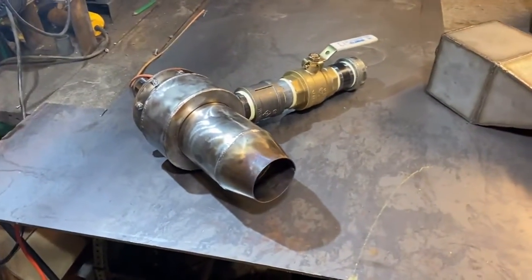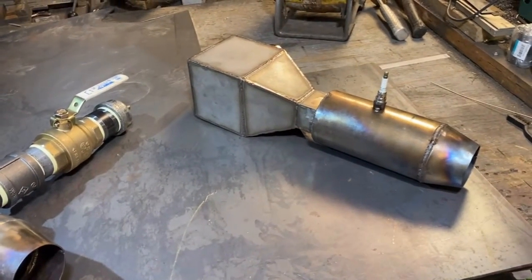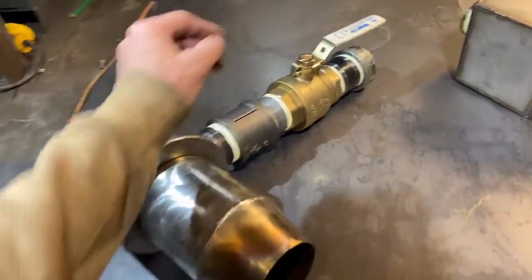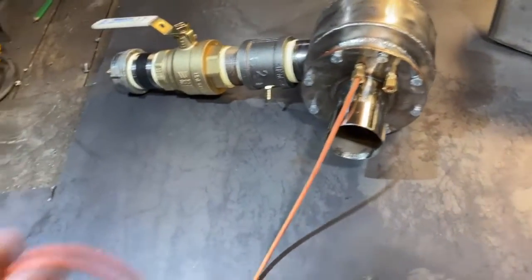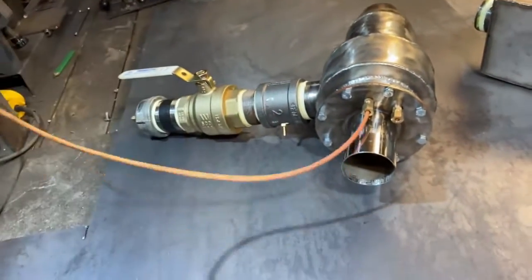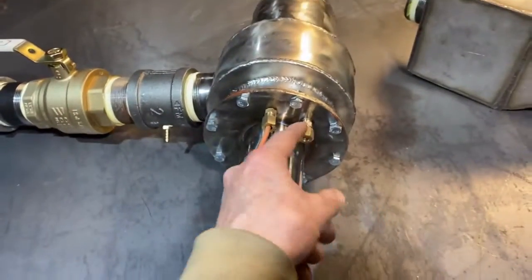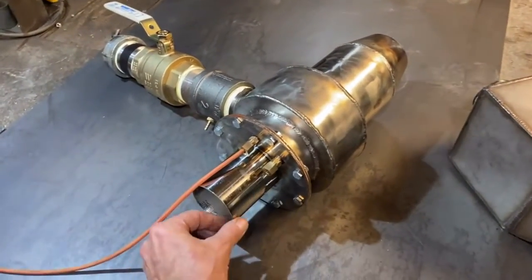It's too expensive. It's on the shelf. We will be keeping that in the back of our head if something comes up and this one can't perform properly because of the gas pressure. This thing did extremely well. This here is our internal igniter coil — you might be able to see that going into the spark plug there. This side here is for our flame rod. This burner will be equipped with some electronics equipment that will shut it down in the event of a flame out.